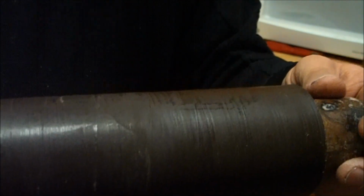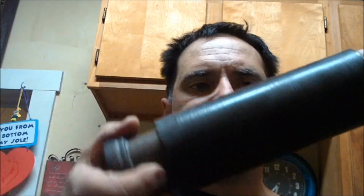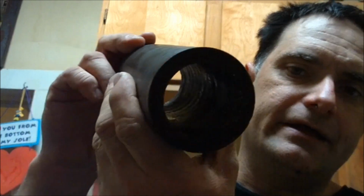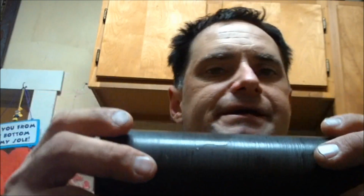We'll have another video at a later time showing the machining of this, probably tomorrow, because we like to let these sit about a day to properly settle. They need to settle to be right. So this is the casting now, and we will remove it from the wooden core. Now, the spiral wasn't as good as I like it. However, it's there, and the record should fit very nicely. So this is a rough casting made with original Edison brown wax from about 1898.